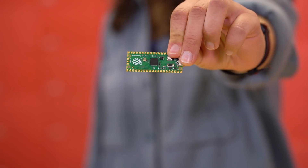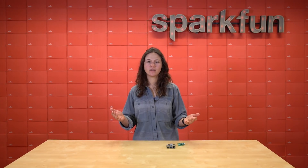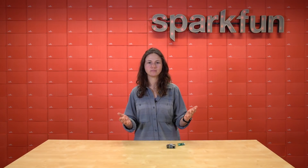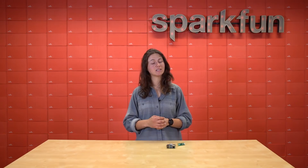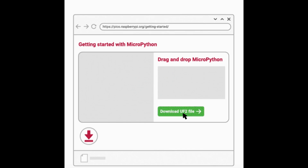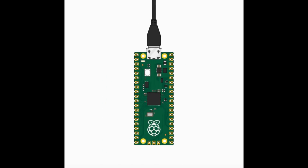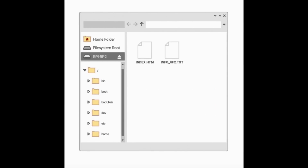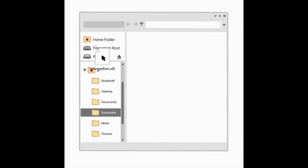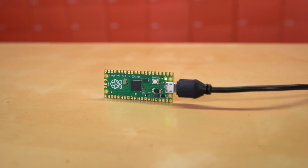We got the chance to play around with the Pico before release, but due to the secrecy of the launch, we wanted to make sure we communicated it covertly. Like anyone in the software world knows, the first key to coding something new is to print 'hello world.' Since this is the Pico's introduction to the world, we might as well say hello — but let's do so in Morse code: dot, dot, dot, dash, dot. The Pico is programmed through drag-and-drop programming. While connecting to a computer via USB, we can push and hold the boot select button until after the Pico is connected. It will mount as a mass storage device, and we can drag and drop a MicroPython UF2 file onto the device. It will reboot and run MicroPython. Using the same basic principles and syntax of Python, we build a script that takes a sentence as input, converts it to Morse code, and blinks that Morse code out via the LED onboard, which is specifically pin 25.